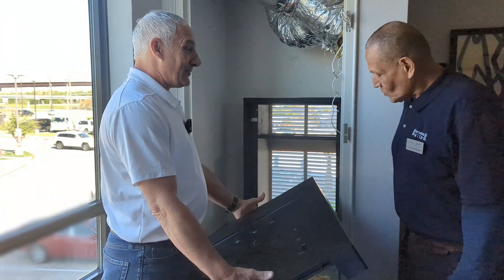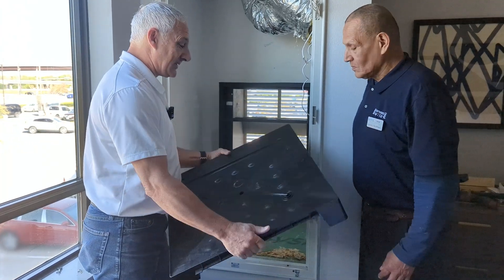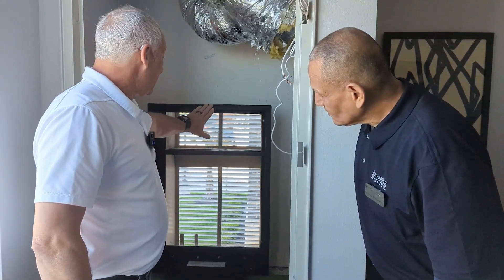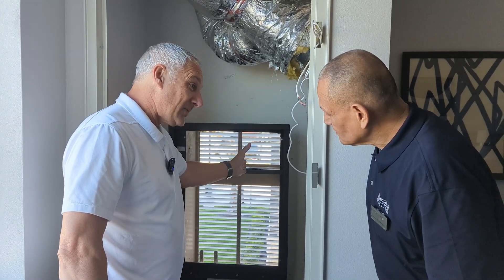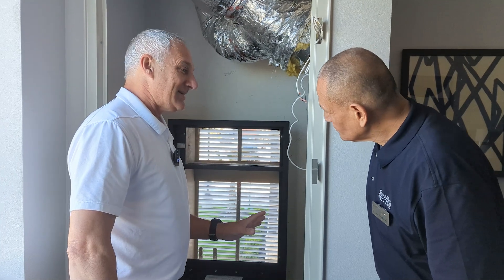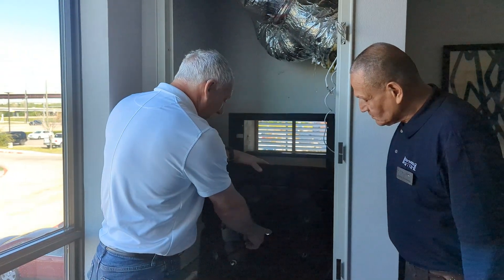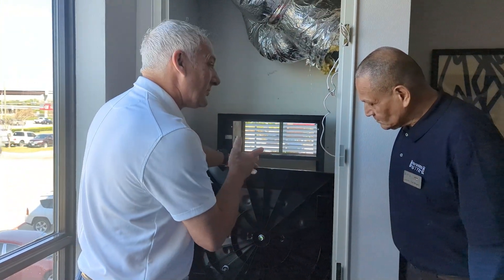What we've got here is our drain platform. Instead of having to build a platform out of wood or use cinder blocks, we've designed a platform that will keep the unit perfectly centered with ridges on each side. Once you push the chassis all the way back against our gasket on the transition — which is a surface mount gasket, so you don't have to wonder if it's seated far enough — it makes it fail proof. Since the plumbing is integrated, we'll attach our plumbing to our primary drain and then attach a secondary drain, get all the plumbing done, and then install the platform.